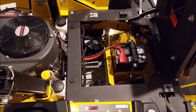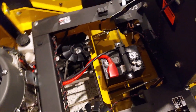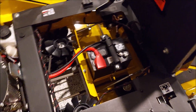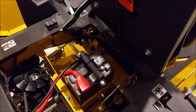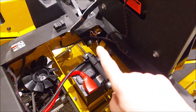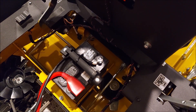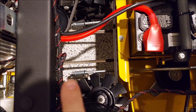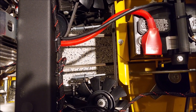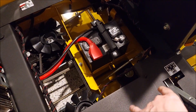Opening this up gives a nice overview while it's still shiny and new. Plenty of room in here — you can get to the hydros, battery right there, full-size battery, decent wire looms. There's a little silver bar on each side that says Excel — whenever you move the arms, that's adjusting the linkage, which connects back to a spring just above the fan. That's how the parking brake is engaged on both sides.